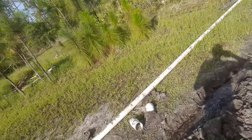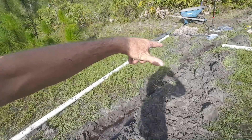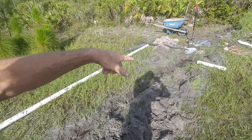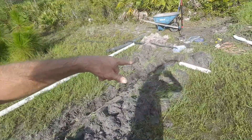This is a great project for the do-it-yourselfer. Granted, I'm covered in sweat — it's early morning and very humid in Florida during the summertime. But it's a simple project. Basically we're going to do a backyard sump pump: connect a gravel perforated pipe which will collect the water, a catch basin back there as well, over to a temporary sump pit — because I don't know if they really want to keep that there permanently. We'll leave an extension cord out for temporary power.